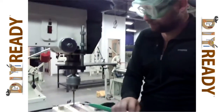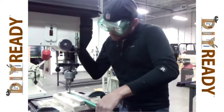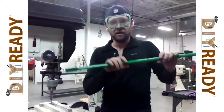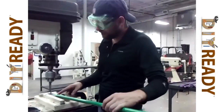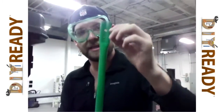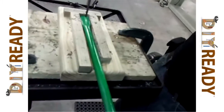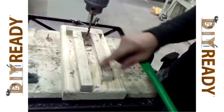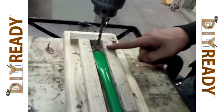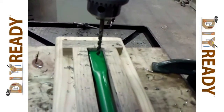What we have here is a little jig we made to drill our holes. In the instructions, you'll see there's a section where you add an inch of length to each end of your piece. The reason why is because we're drilling a hole centered to the piece at exactly one inch. The center of this hole is centered that way. It's two pieces of wood to guide it in, a piece of wood to stop it, and I drew lines to indicate where the inch mark is and the center line. Then I line my drill bit up and here it goes.